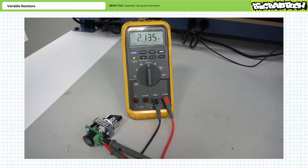Checking resistance between A and B shows the remaining 2.1 kilohms. A turn of the knob changes the resistance between A and B to roughly 1 kilohm, and switching the ohmmeter back to the B and C terminals shows the remaining 4 kilohms between B and C. For every ohm decrease on one side, there is a corresponding increase on the other and vice versa.